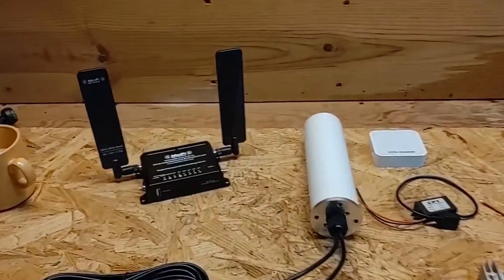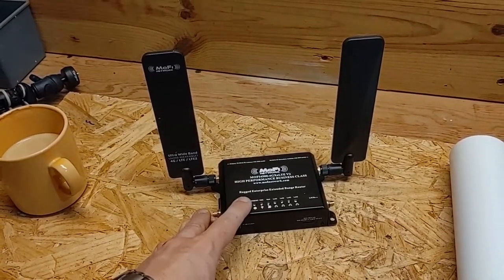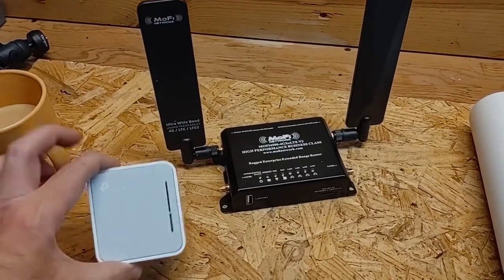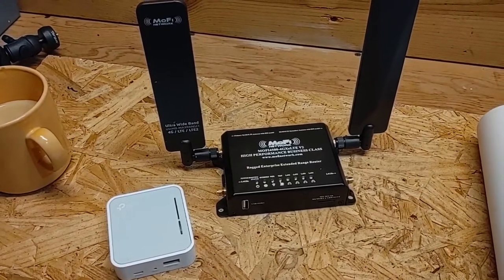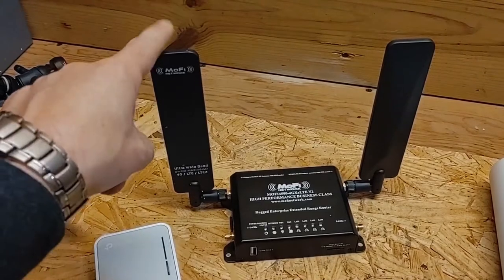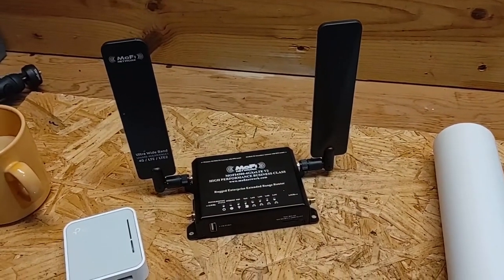Here are all the piece parts. This is the LTE modem and gateway — it's a really nice firewall modem device, but I usually use it in pass-through mode at the house. I've gotten tired of switching it to Wi-Fi router mode every time we go out, so I've bought a little travel router to use in the camper, all set up and ready to go. One thing you'll notice is this has Wi-Fi antennas, but I'm not using the Wi-Fi features — I'm only using it as a modem. It has two antennas for the 4G LTE setup, which they call MIMO —